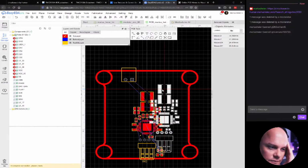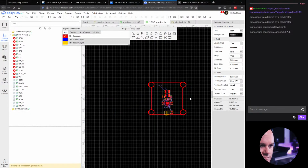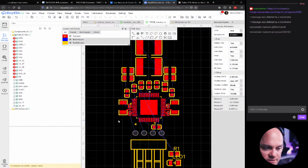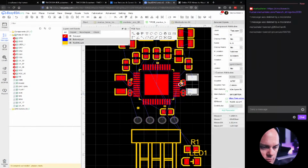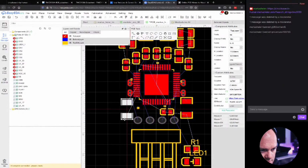How much less? So what I basically need, if I'm actually going to fit 3, I could also do it with 2. However, it's quite useful to have 3 because many drivers have 3. So we could make the sense resistors smaller. We could also move some of this stuff. I could flip the sense resistors like this and make the tracks longer. To do something like this.